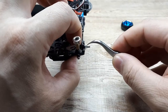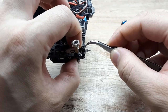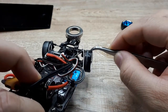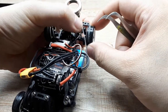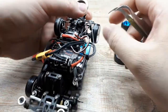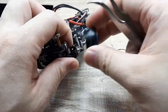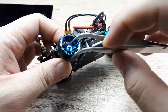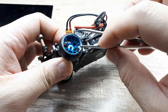So in order to make this flat part move inwards, I added three washers in between those two bearings in the back, and two in between the bearings in front. Now I have absolutely zero play. If I hold the upright here there's no play in the wheel at all — the only play is within the suspension. So the first thing you should do is check your wheels to make sure that flat spot is actually inside the surface of your wheel.